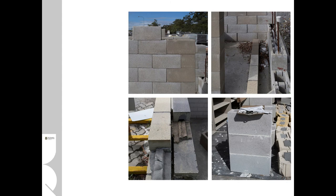One thing to note about concrete masonry in general is that they're moving quite quickly to a much more controlled system. In the top left-hand corner you can see a dry stack system — no mortar is used whatsoever; it's just dry stacked, and the core filling gives the wall its integrity. On the bottom there are experiments with automated distribution of mortar. In the bottom right-hand corner we can see three blocks in a testing station that have been literally glued together, so instead of using a mason's technique, an applicator literally sticks the blocks together. This is one step closer to a realistic application of automation.